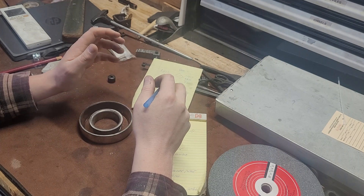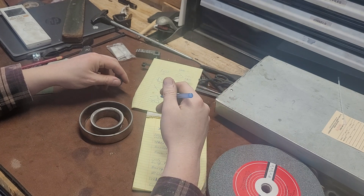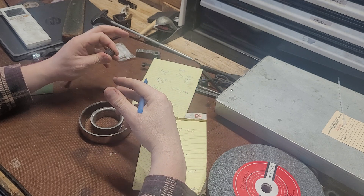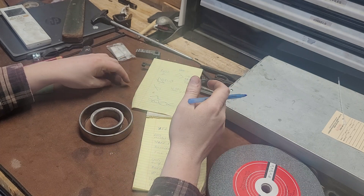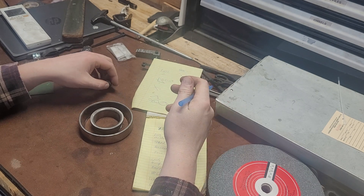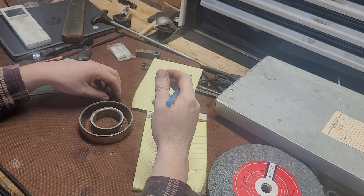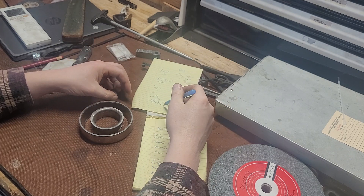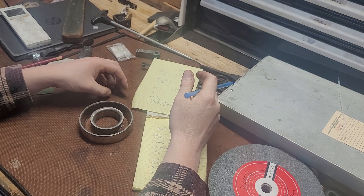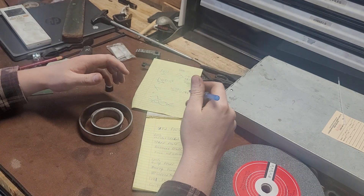Grease selected for your older greasable motors is really important. Because of those voltage spikes, you can actually burn up the insulation inside your old motors. It's more of an issue if you're running them at 440 volts. Most of us wind up running 220 volt VFDs, so these issues are mitigated by running at lower voltage. In industry, people can run VFDs at 800 volts, and a lot of commercial HVAC systems run around 440.